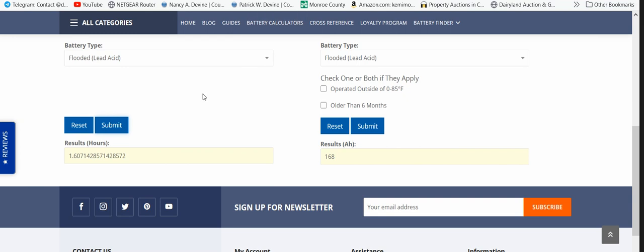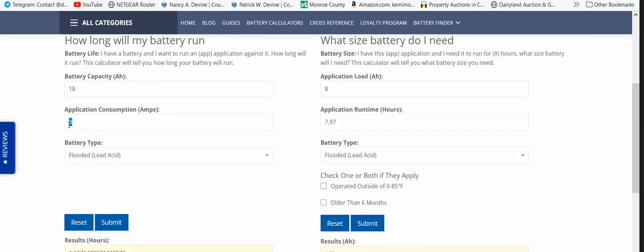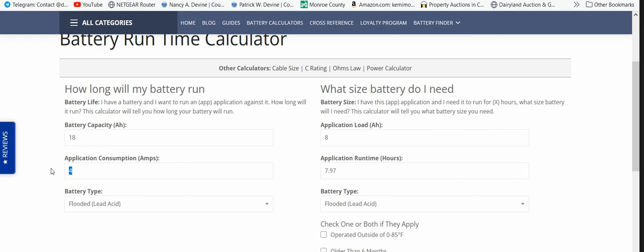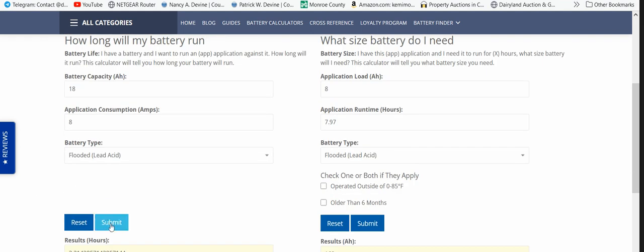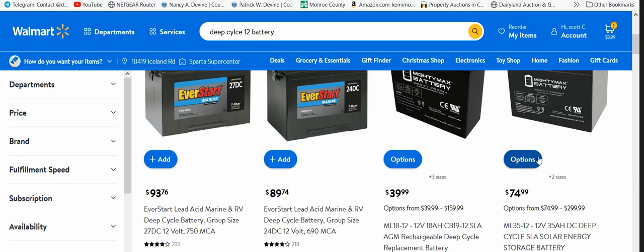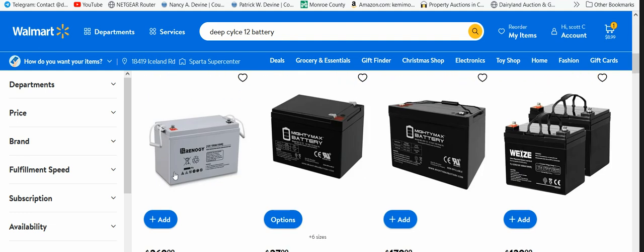In reality I could cut this down — let's say the repeater is half busy and drop to 4 amps, since it's not constantly drawing the full 8-amp load. At 4 amps I get 3 hours. Keep this in mind with these calculations. Going back to 8 amps with that 18 amp-hour battery gives 1.6 hours. We can get more runtime if it's not constantly under maximum load.